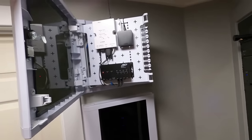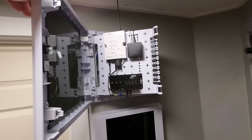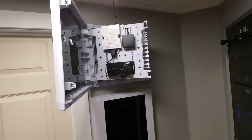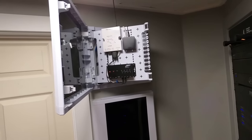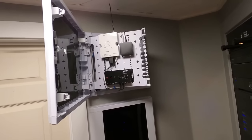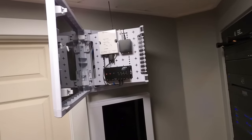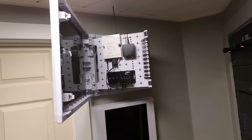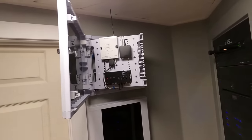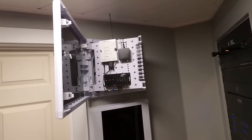So to kind of recap, we're using the Lutron system for basic can down lighting and to control various on functions only. We're basically using the Lutron to turn on the power supplies that run our RGB lighting controllers and star ceiling. That way we can have them preset to say we want the whole room to be blue. We set that up within the RTI touchscreen, and that will revert back to that same command every time the customer, in our case the demo room, hits our Lutron Pico switches. So it's a simple but very effective way to control that lighting features without having to pull open a remote control or anything else.